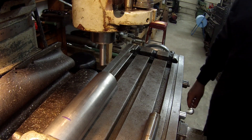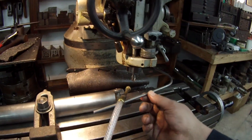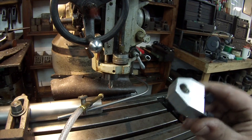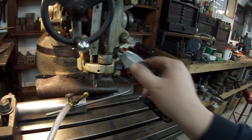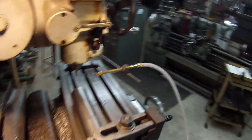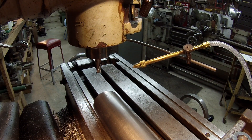Let me get my cutter set up and we'll get the Cool Mist set up. I'm set up and getting ready to start cutting. Here's that rod that Tom Lipton made for me — does a nice job holding the Cool Mist stem. This is one of those little quick clamp stops for the quill that my buddy Gil gave me. He bought it and gave it to me — I've never had one of those, that's a nice thing to have. Thank you Gil, I appreciate it. I'm milling half inch keys. I checked my chart — I was thinking 5/8 but it's actually half inch keyways that goes on this shaft.